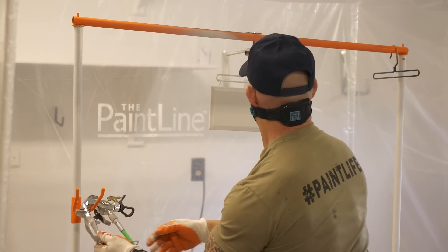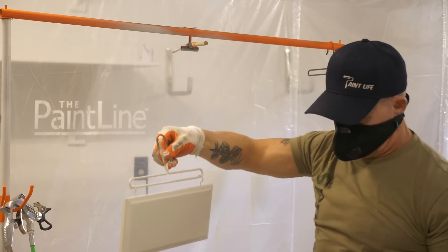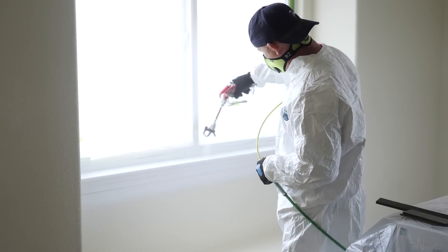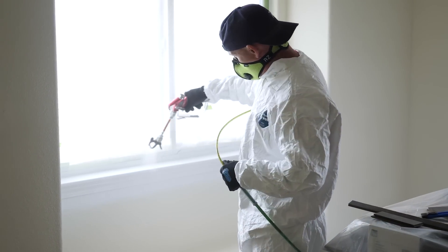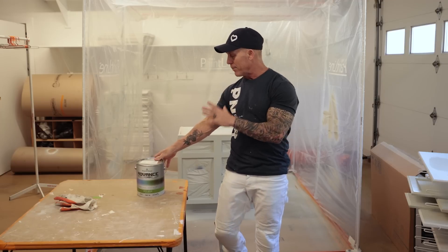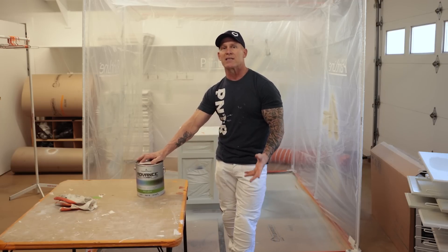For trim paint, this would be a really good choice for painting interior trim, door jambs, window trim, and baseboards — especially if you're brushing and rolling. The slow dry time and ability to level out is absolutely amazing. On trim, we typically don't sand between coats, so you can apply a second coat a bit quicker. In our conditions I'd still adhere to the manufacturer's recommendation of recoating at 16 hours. Spray one coat of trim one day, come back the next day and spray the second coat right on top. The way it sprayed out on cabinets was just absolutely amazing.